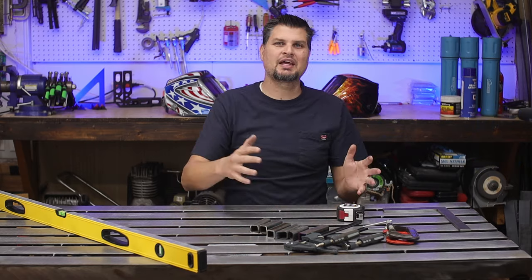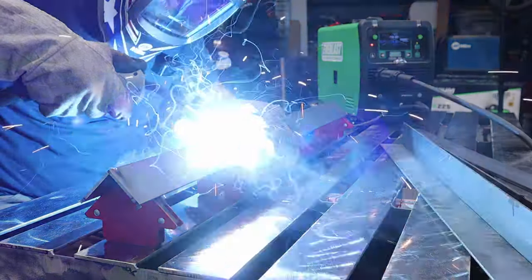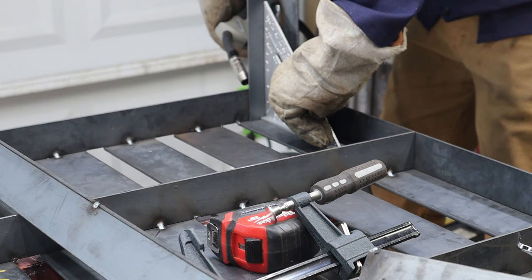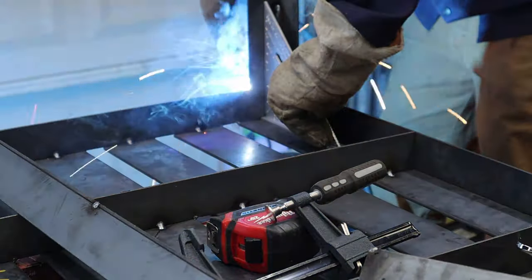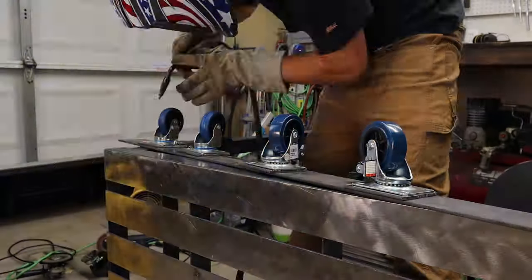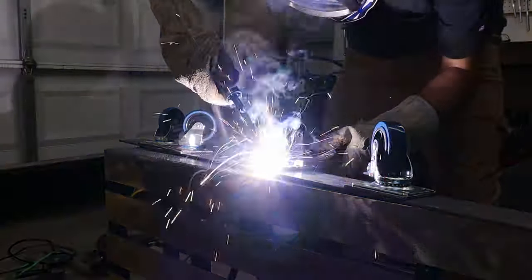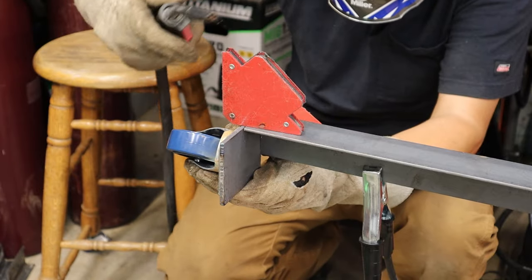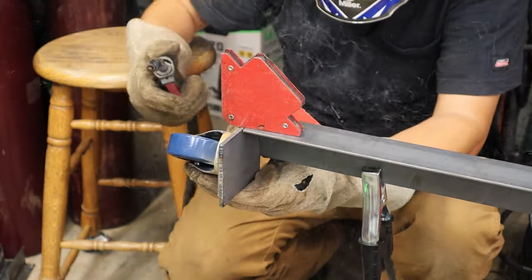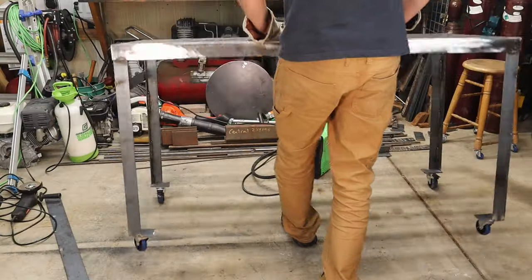How did I do the legs? It's simple — just two-inch bar; I made my own angle. I know I could have gone with square tubing or 50 other different things, but I went with this and it works. They're plenty strong enough. I know the caster connection is ugly, and if room allows, place those casters in the center of the legs. Where mine is going, I'm maxed out on that five feet, so I couldn't extend or overhang them from the legs. Either way, these work fine, but as a design standpoint, you do want to center the load directly over your casters.